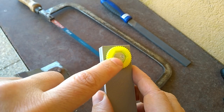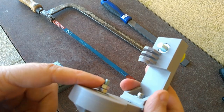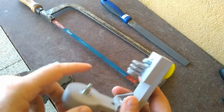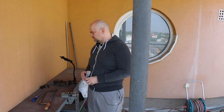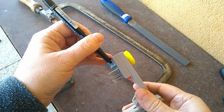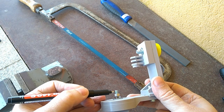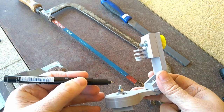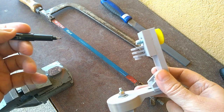I have to cut down this M8 screw with the hexagonal head, and this will be easier to do compared to this M5 with the cylindrical head. I will use only very common simple hand tools. The first step is to mark where you want to cut it — measure and mark, always add a few millimeters, one or two, because you can easily remove material but you cannot add it at the end.